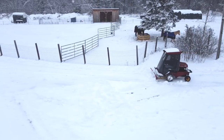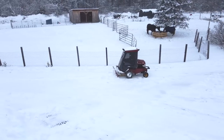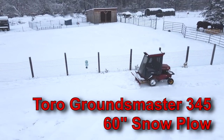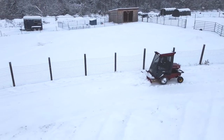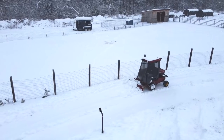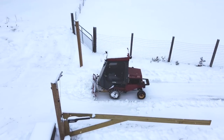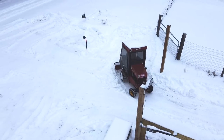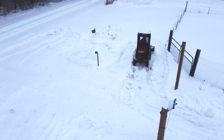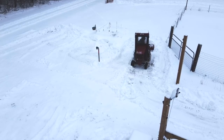Now let's move on to my preferred way of removing snow here in rural Maine, and that's with a garden tractor snowplow. The machine you're looking at here is a Toro Groundsmaster 345 with a snowplow on it. Snowblowers and snow throwers rely on engine horsepower to remove your snow; garden tractor plows are going to rely on traction and weight to move the snow. Garden tractors are still plenty heavy to plow snow — this one is on the heavier side with the cab, I estimate about 1,800 pounds. But I'll show clips of other garden tractors that are 800 to 1,200 pounds that remove snow fine as well.